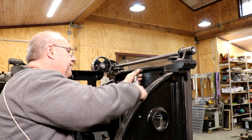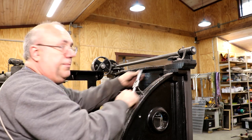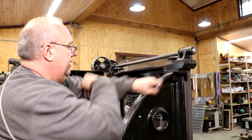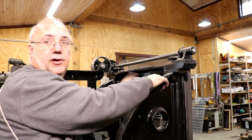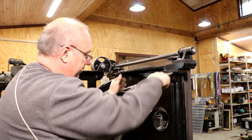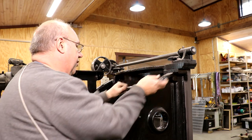Tap this hole as well. I went and checked — I don't have a bottoming tap, all I have is a taper tap. Ideally you would want to run a bottoming tap down that hole so you had threads all the way to the bottom. I don't have one this size, but I think my holes are deep enough that it's not going to be an issue since this is not a through hole.